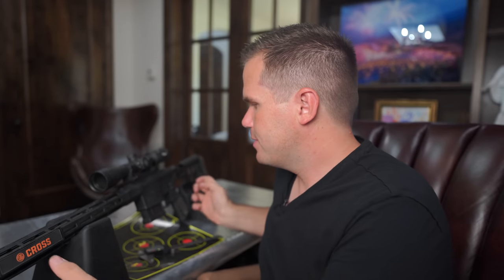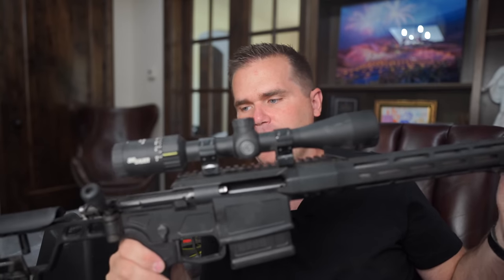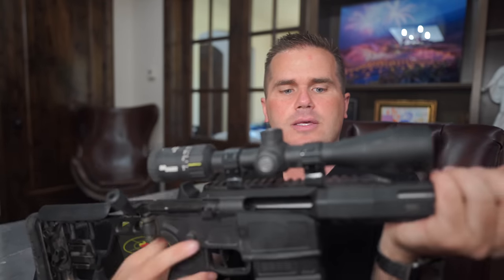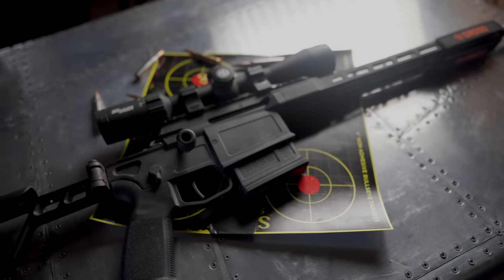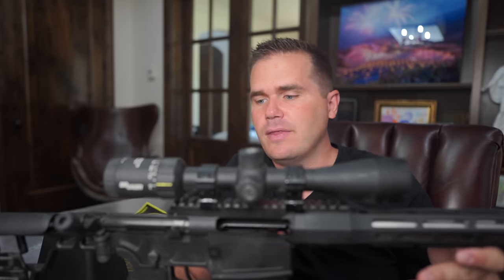What exactly is it? To an untrained eye, you might say it's like an AR-style gun for hunting. But this is actually a traditional bolt-action hunting rifle. I hear people say it's a chassis gun — it's not a chassis at all. This is a one-piece receiver, and that's really one of the defining characteristics that makes this unique. It eliminates a lot of issues where misalignments can be introduced, as well as no need for worrying about bedding. The design makes it more accurate and less prone to error.